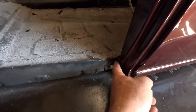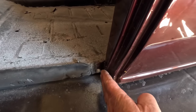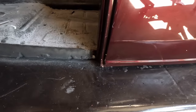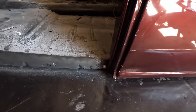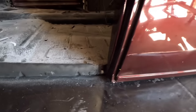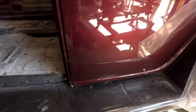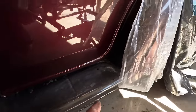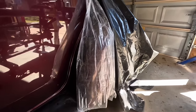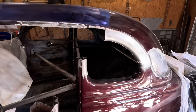If you look here, this does look bent - like the whole quarter is forced forward. There's no easy way to fix that without either cutting the whole quarter panel and moving it over, or possibly unbolting the running board and then tying a chain to the back of the body and pulling it a little bit. Let's get started on this quarter now.